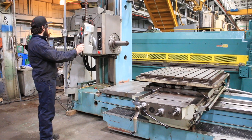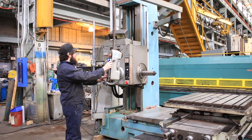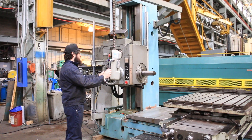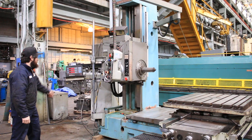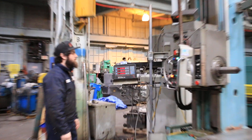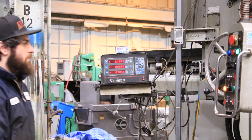We're running the headstock down. The headstock has 44 inches of vertical travel. By the way, the cross travel is 49 inches, and the longitudinal saddle travel is 65 inches. Now we're running the head up. You can see there's a three-axis DRO for the travels of the headstock, the saddle, and the cross.